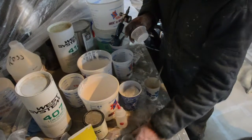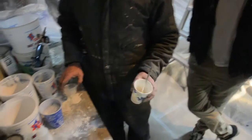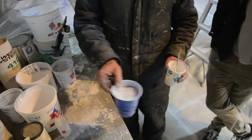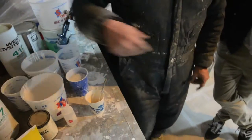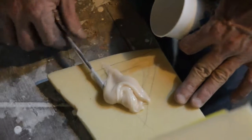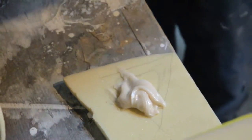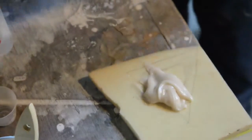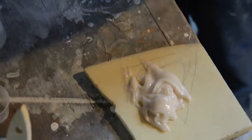So what are the two things that's in there again? It's the epoxy resin and the hardener, and this, the colloidal silica. And then what was this 410 stuff? That was like the brown. 410 is your fairing color putty for the bottom. That's your bottom shaping putty. Okay. So you have this massive thing.